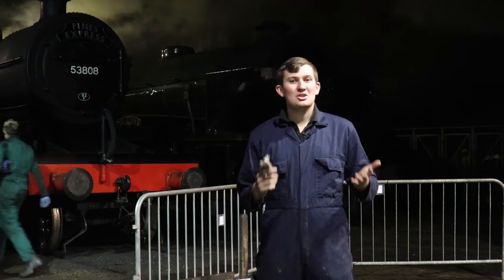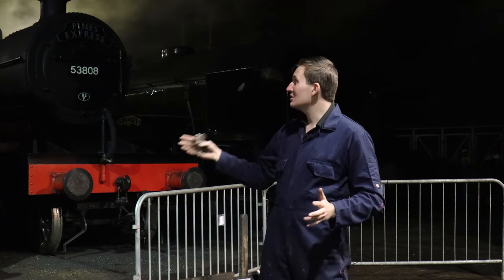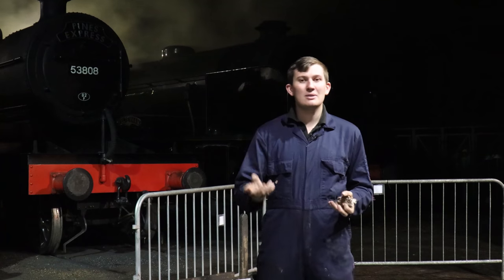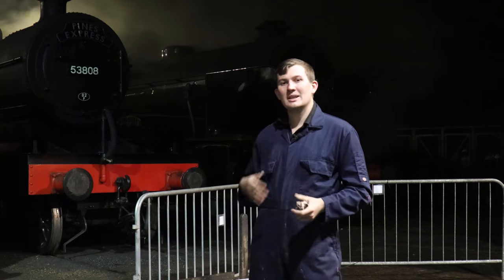So the ultimate question, essentially, we don't light up much differently, so we still do a bed of coal, but now if we've got some steam for the blower, we'll cover the whole fire lightly with coal. We'll then put some wood on top, and then same again, some lit rags, a bit of wood, and then start feeding it slowly and bringing it round.